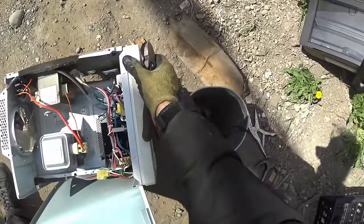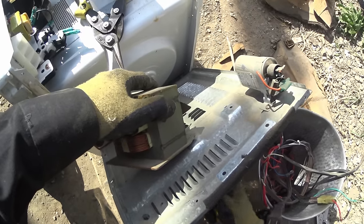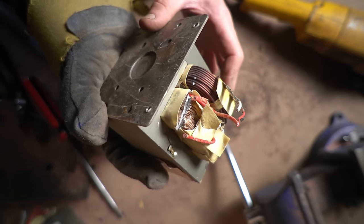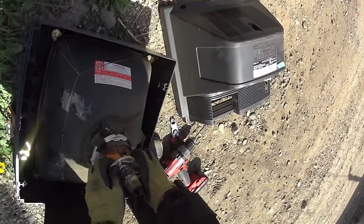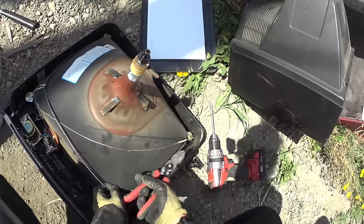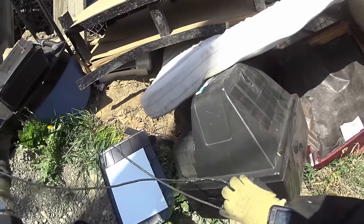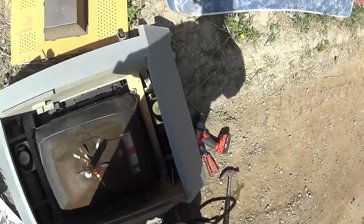Let's begin where a lot of us probably started scrap collecting. Number one and two are microwave ovens and CRT televisions. Both of these items are on the list because they don't take very long and you'll get about a pound of copper. With the microwave oven there's a transformer inside, hopefully half of which is going to be copper windings — sometimes both are copper windings — and then there are a few other little motors and such which are pretty easy to take apart. The CRT television has two good spots for copper: the copper-wound yoke on the back of the tube, which is easy to get off but not always easy to separate, and the second source is a degaussing cable which wraps around the tube. Sometimes these are aluminum windings, but when they're not, it's not difficult to strip the tape off and you'll have a good fistful of copper. A larger television sometimes has about two pounds of copper. Maybe don't scrap any really fancy ones though — some are worth a bit and they're not making any more.